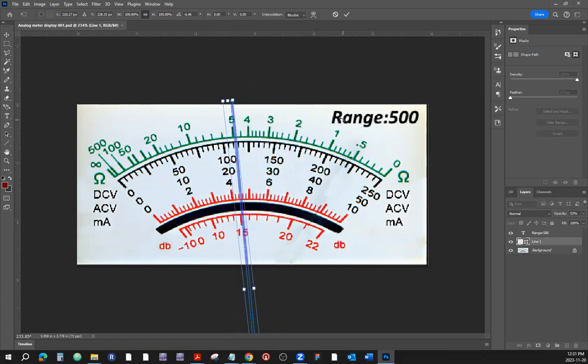So let's say the meter is selected to a range of 500 and we are measuring DC voltage — preselected to 500 volts, meaning we can measure voltages up to 500 volts. And let's say the needle has swung to somewhere here. That's the indication by the meter. The range is 500 — what is the voltage?